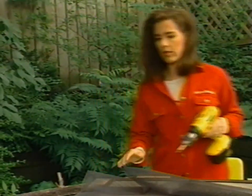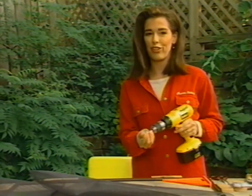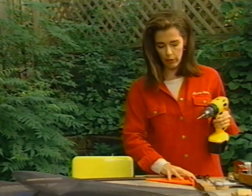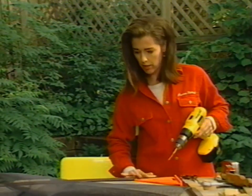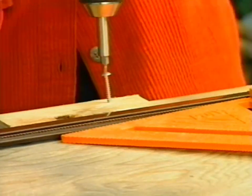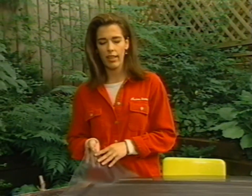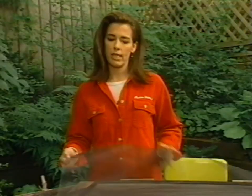The drama of the setup is going to completely outclass the non-drama of replacing the screen, although you never know quite what to expect. We're using vinyl screening — it's very lightweight and it tends to pucker a lot, so I might have spoken too soon; there could be drama yet. Screening material comes in three different materials: vinyl, fiberglass, and metal. Vinyl is very flimsy so it takes a bit more care to put in, and metal can be a bear too, so they're all a bit tricky.